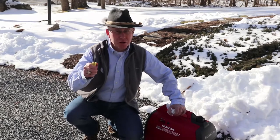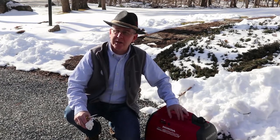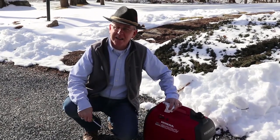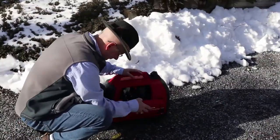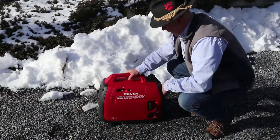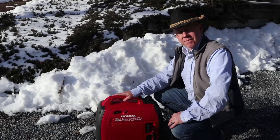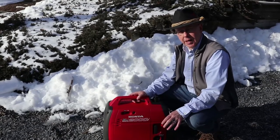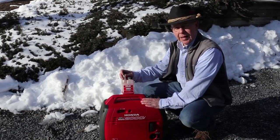As part of your mid-winter check, don't just worry about your RV or your truck — also worry about accessory items like your generator. I always try to run it at least once, maybe twice during the course of the winter season. We're going to start by checking the oil first, then get her started, let her run and heat up. We got it up to operating temperature and ran it for a while. And don't ever forget: if you have to put fuel into this and you're going to store it for more than one to two months, use fuel stabilizer. You'll be glad you did.